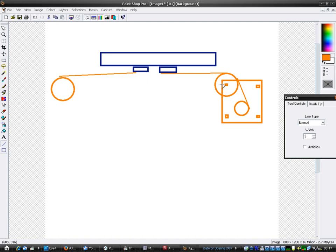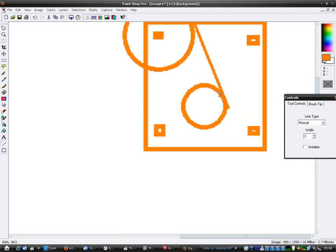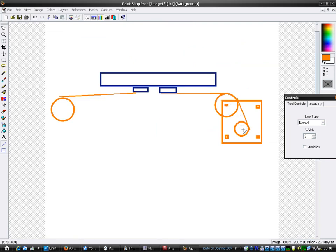I'm 3D printing a spacer and another. I'm going to incorporate a bearing on the edge of that motor there, so that the belt is directly in alignment with the table. Because I've got a new belt now, but I'm just waiting for some new gears for this motor, because the gear that's on there is 3.5mm wide, and I'm going to be using 6mm wide belt, and it won't fit on that pulley, so I've got to wait for the new belt and two pulleys to arrive really. But you get the idea.